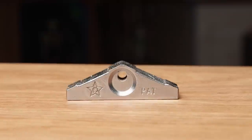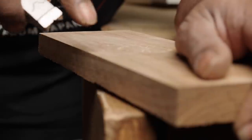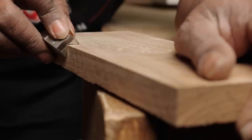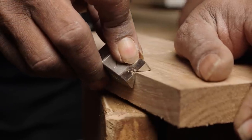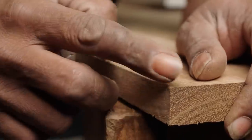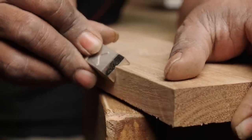So the next one is the steel type trimmer. I prefer to use a 0.6 mil chamfer because I find that the 1 mil sometimes with Australian timber tends to dig out a bit more, so I usually go with the 0.6 mil on Australian timber at least. And as you can see it's done a very nice job — very, very smooth. This is a bit of spotted gum.